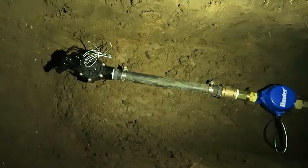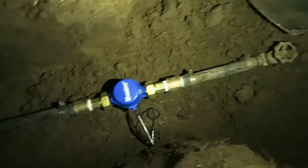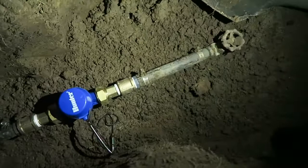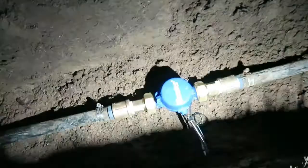I've got the master valve installed and the flow meter installed. I reread the instructions — it said 12 inches with no 90s, didn't specify any other obstructions. So I made sure this one right here is 12 inches long. This one's a little bit shorter, but this gate valve will be normally open and if it's always open that shouldn't restrict flow very much. Let's go ahead and fire this up.